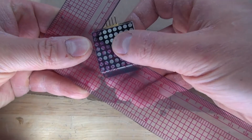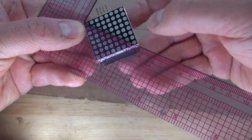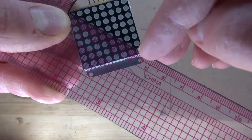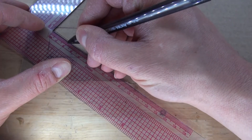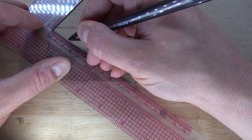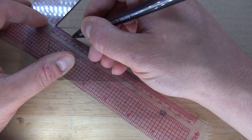Turn the LEDs at a 45-degree angle and measure from one corner to the other corner so that I get the proper size of these LED Matrices. So far it measures at 4.4 centimeters. Now I need to go to the center of the X and measure on each side, measuring out a line that is half of 4.4 centimeters, which is 2.2.